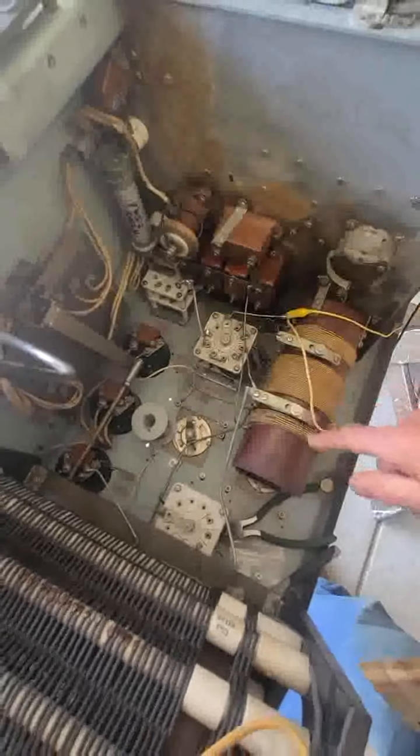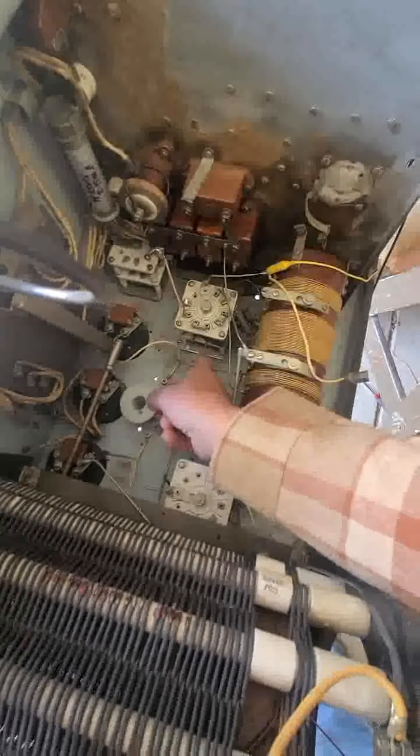This was gutted of a lot of parts, because the guy didn't have any use for it, and he needed to use parts from this to make a switch here for the tune, operate, calibrate switch. Buddy Tom in Richmond had one of these type switches. I made a new base plate with the spring detent to give you your stops. This one's got an 8 position. This one over here is the hardest one to actually make. This one I have is a 3 position for tune, operate, calibrate. And anyhow, got that.